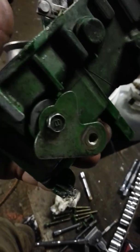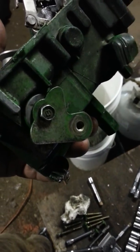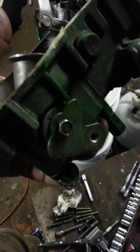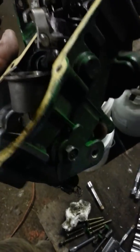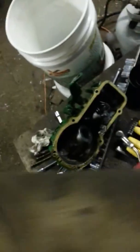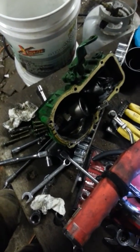There's a two-lobed spline system on it. Pull that apart — all it is is an ordinary o-ring in there. Put a new o-ring on, tighten her back down. Torque was about 12 to 14 foot-pounds — not very much. Then put her back together.